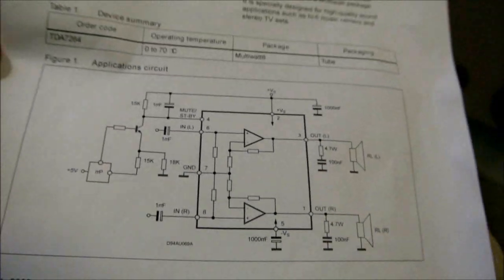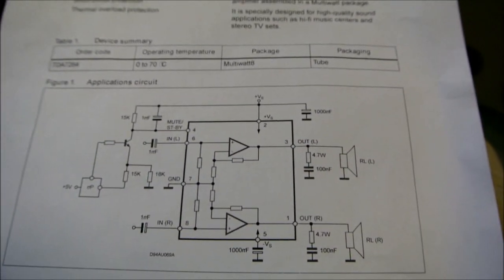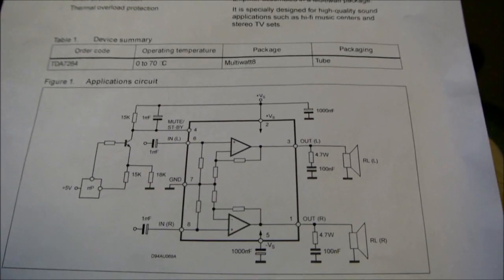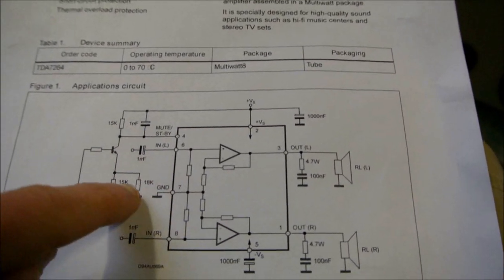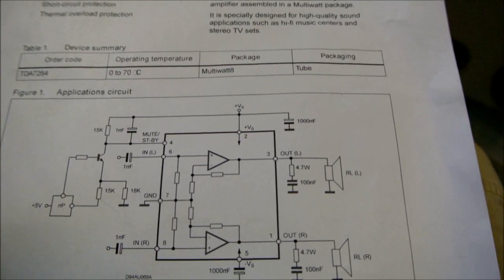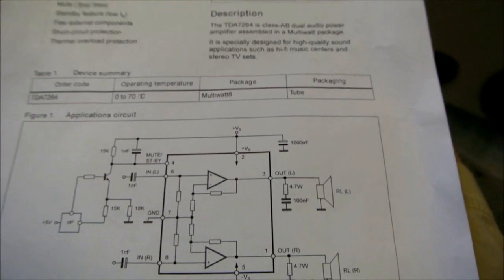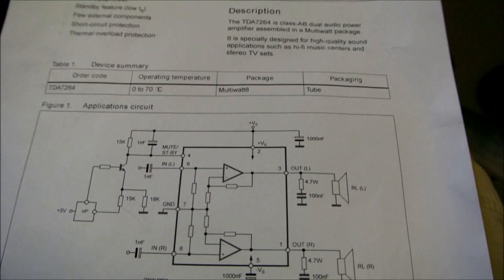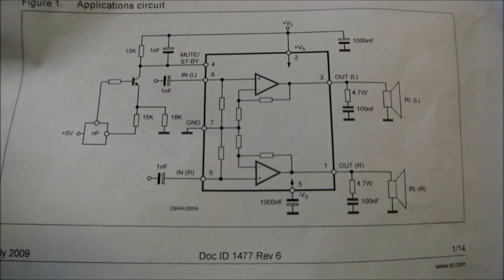However, with a music player like an iPod — those headphone stereo things — the maximum output is around 500 millivolts RMS. And with 30 decibels of gain, it doesn't quite drive the amplifier loud enough when you turn it up. You really need around 40 decibels of gain, depending on the actual output of your amplifier.